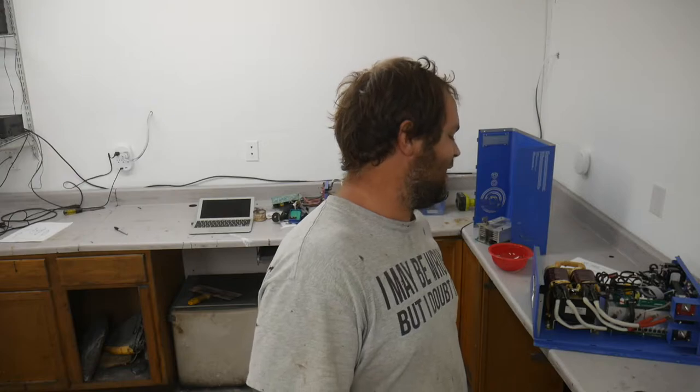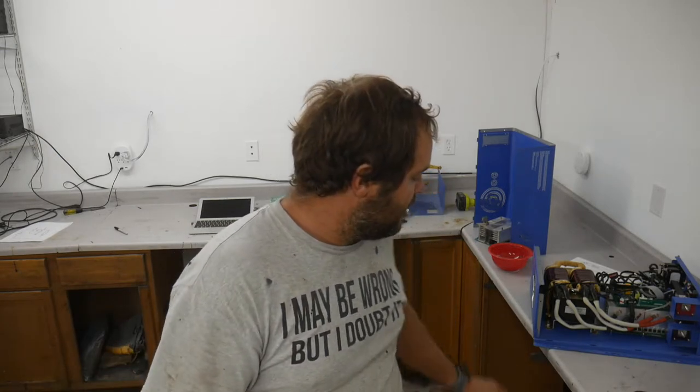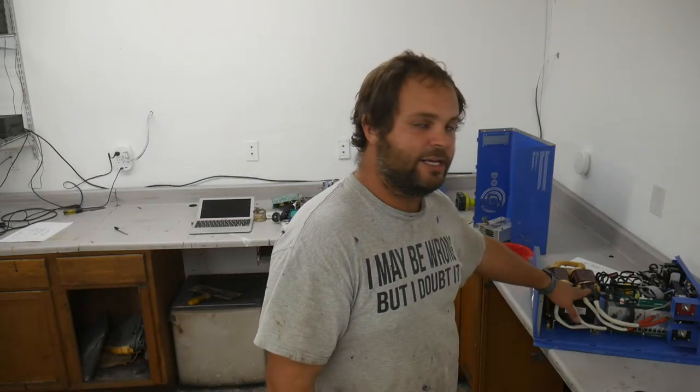So back to what I'm fixing to explain that's incorrect. This is just a simple layman's term, really easy to understand. It's the best way I can do it. A transformer has a limited ability to move power through its two sets of windings, and this is limited by the size of the core. If magnetism had a volume unit, you could describe the volume unit of the iron core of that transformer. Once the transformer's iron core gets up to its maximum amplitude of magnetism, when it's not increasing in magnetism anymore, the transformer is no longer transforming power, because it has to be increasing or decreasing in magnetism to induce a voltage in the secondary windings of the transformer.